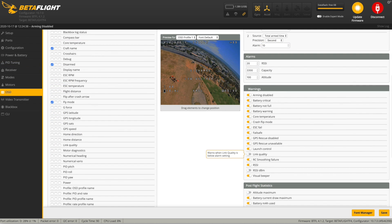I did a little bit of research on the link quality warning and found out it's a warning that's not normally switched on — it's just something in the OSD, and I've now switched it off. It's basically triggered by a rapid drop of RSSI going under around 70%, which I didn't think warranted a separate warning, because when my RSSI gets low I get a warning anyway. Going between like 90 to 70 doesn't seem a big deal to me. So I turned it off and went back out again to refly it and see what we came out with this time.